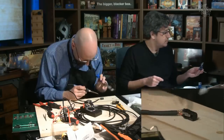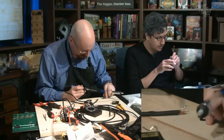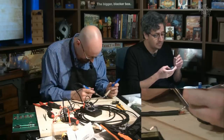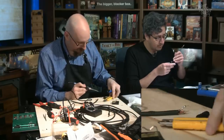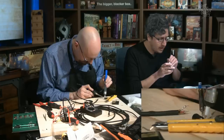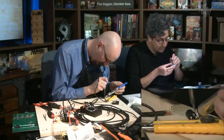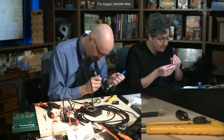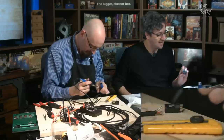The whole problem was that the area where you plug the power nozzle into the hose handle, the power jack on the inside, had been pushed backwards over and over throughout the years. So you could no longer get a firm connection. It would sit in there for a bit and then wiggle its way out. So I built a leaf spring out of an old loyalty card by chopping it into small pieces and layering them together. Put the whole thing back together, and now I have an incredibly solid connection, and it's really fun to vacuum.